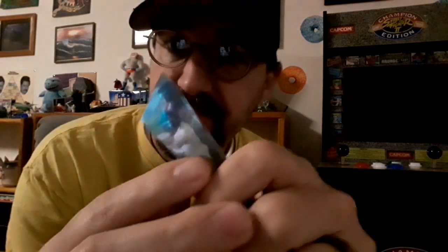But this has got this corner right here jacked up. This corner is your primary cutting surface for most things, because you use it kind of like a scalpel. I don't know what happened because it's been so long. This may have gotten dropped, probably got dropped. I really don't know anymore. So I'm going to have to redress the face of this and pull back past this tip slowly and carefully without burning it, and get this cleaned and repolished.